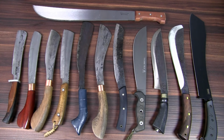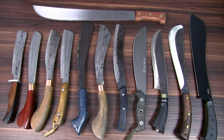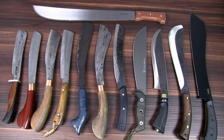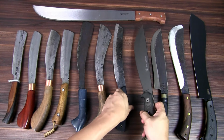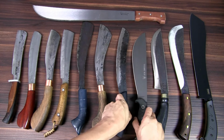So speaking about tangs, you have the full tang and you have the rat tail tang parangs. Traditionally for Malaysian parangs, they are all rat tail tang, and there are several reasons for that, due to the traditional construction method. Also, if you need to replace it, it's easier to replace the handle. But with modern knife making and consumer demand, they do like that full tang blade, so you can get it as well from more modern makers.